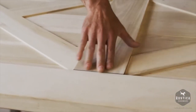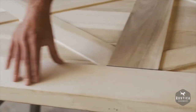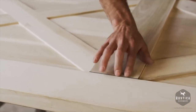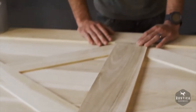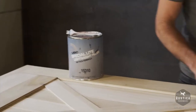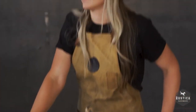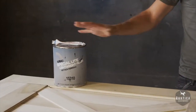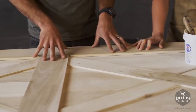Let's talk about the Bondo. Any larger gaps where you'll have joints - you can see where we've already put Bondo at this joint. This is the stile of the door and this is a rail, so there's a joint right there where this comes together and this one happened to have a little crack. Fill it with Bondo because it'll stay together. Wood putty will chip and fall out - it's just for small spaces. But for this door, we actually want character, and we're gonna show you how to do that next.